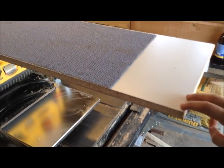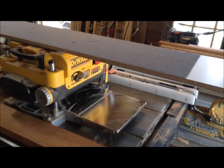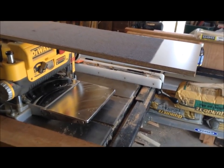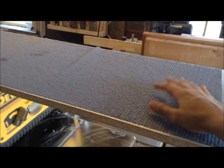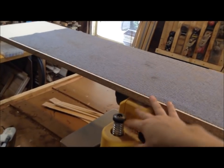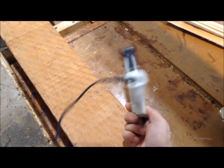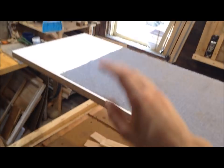I opted not to put a cleat backer on the front or back. I've never had a problem with pieces moving around too much in this planer so I'll try it out and add one if needed. I did have this fairly large piece of rubber matting — the non-skid gripped mat people put in their toolboxes — that the wood can sit on top of. I'm going to use a construction hot glue gun, which is a little more durable than the smaller ones, to hot glue those shims in place. Because of the coating, I'll be able to pull them right off once I'm done.